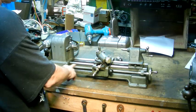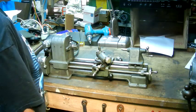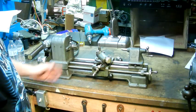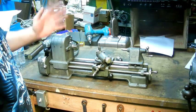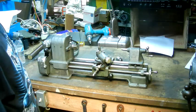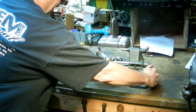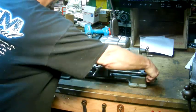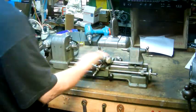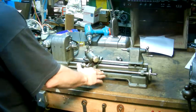There's also no true longitudinal feed on this. You can engage the half nut and use the threading gears on the end to feed longitudinally — obviously you need to be aware of wear on the half nut if you're doing that kind of work, but that is definitely possible. And if you want to be able to do a fine feed, there is a hand wheel on the end that you can turn to feed the carriage back and forth. Take the half nuts off and it just slides back and forth and you can lock it in place.